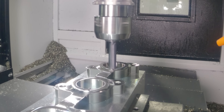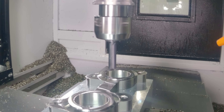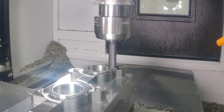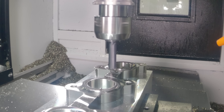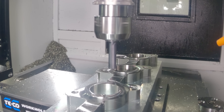We're going to come in with a half inch end mill and finish that top face. Then we'll drop down with that same tool to finish the floor and finish around these bosses. The half inch tool has a 60 thousandths radius, so we don't have to do anything special there — no surface blending. We're just going to go right up to that wall and do our finish pass.